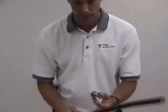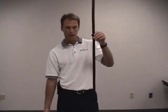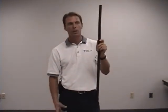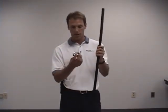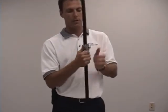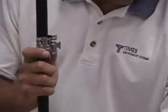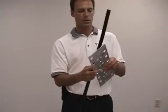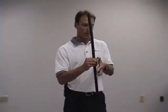Very simple to use. You'll have your cable already hanging in the tower. If this is a tower that's hanging down like this, you'll have your cable ladder or whatever other accessory you're going to use to attach to the tower. Just take the snap-in hanger, slip it around the coax — you can see it's nice and snug there. The snap-in hanger is designed to go in anything with a three-quarter inch hole. These are all three-quarter inch holes here. If this was running up the tower, you just squeeze it together, pop it in the hole, and it's installed.